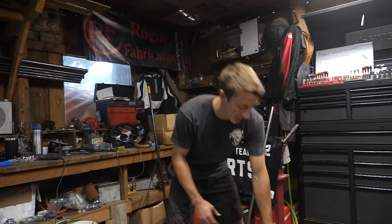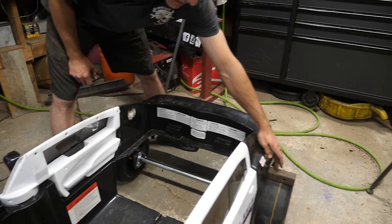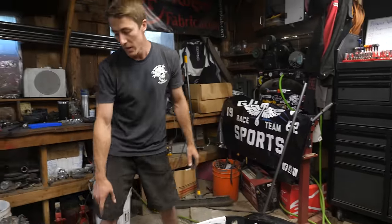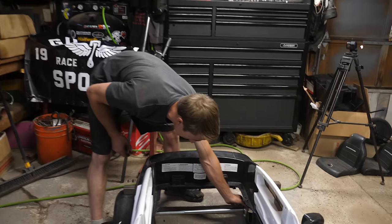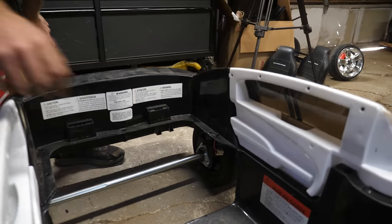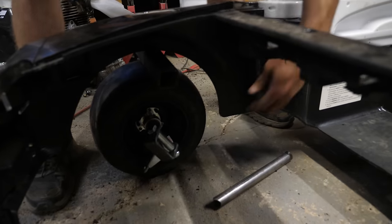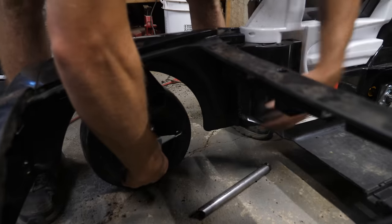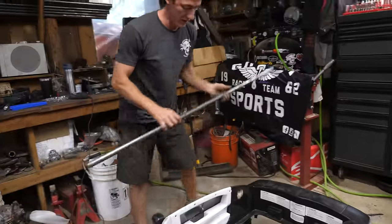After I cut out the back here, it let me choose the height for the axle. Then I just put these in to space the body out an inch and a half in case we ever want to swap the tires out. I did it up front too, and threw these bearings on the back — this is what's going to be mounted to the frame just to keep that axle nice and stable. Up front with the spindle at the inch-and-a-half body gap, this goes that way for the tie rod. The bar wouldn't be a straight shot from the back bearing all the way to the front, so what I did is I cut a section and I'm going to tack it onto that bearing.